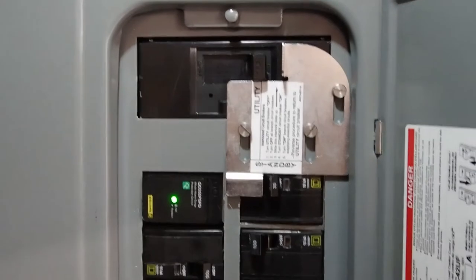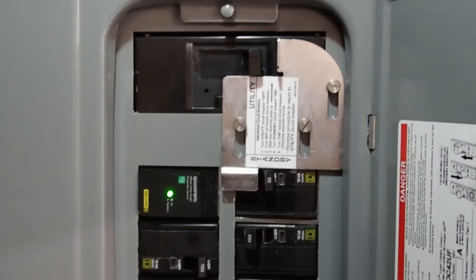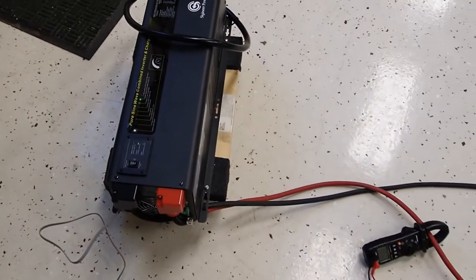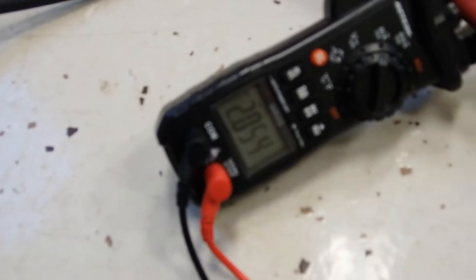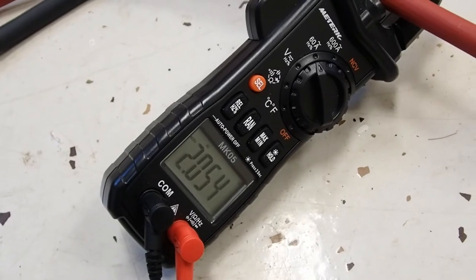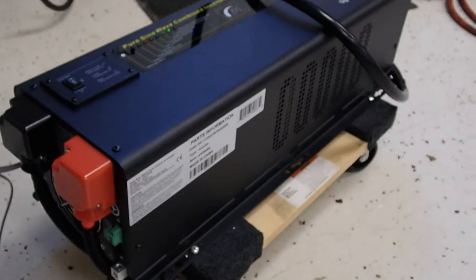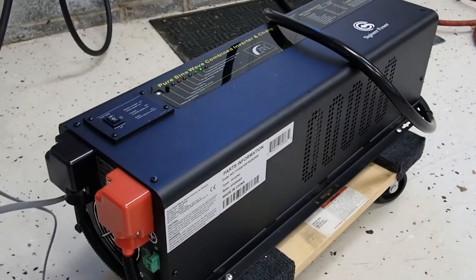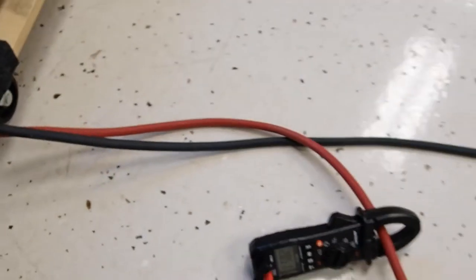It's not too much work to connect, and I can run my whole house without dragging extension cords through it like with my last setup running an inverter off of the Tesla. Back up in the garage — the inverter is still connected and powered up. Just a few seconds after switching back from grid power, we are now pulling just two amps from the mower — two amps at 48 volts is about 96 watts, and that is about the idle consumption of the inverter itself, which is 90 to 95 watts. So there's no load on it right now, and I will go power it off.